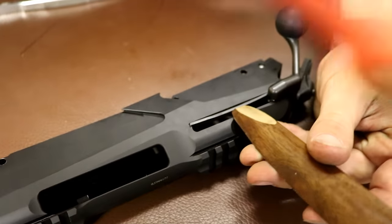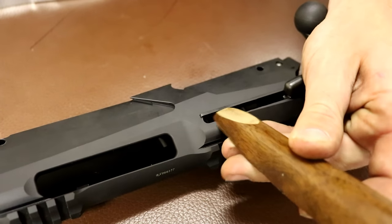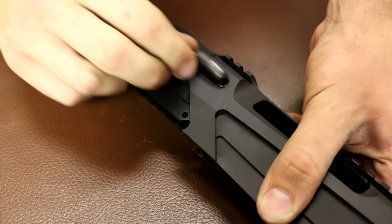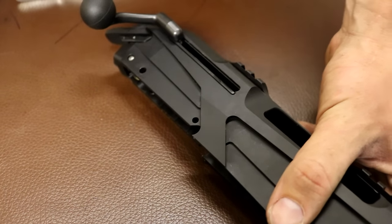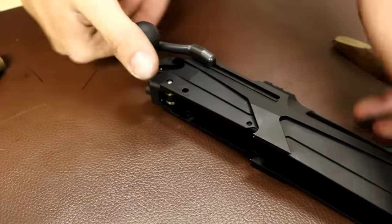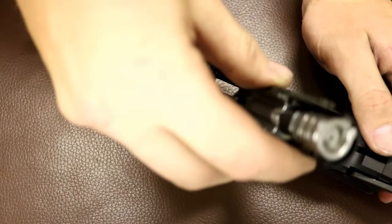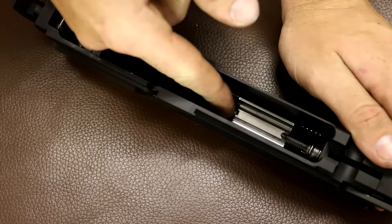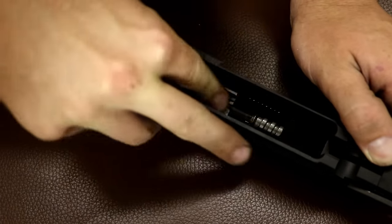Once one end is located, give a little tap with the back of a plastic mallet and bend through the middle with your thumb to seat the head of this plastic back into this little notch here. You should now have a curved arc with both ends properly located. Bit of hardwood back in the middle and give her a little tap. Skip that a few cycles to make sure she's all okay. Then the bolt goes back in the way it came out - tail end in first, and it will fall straight into its hole.